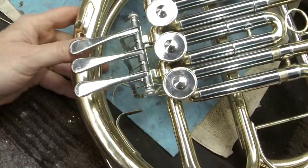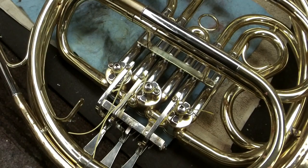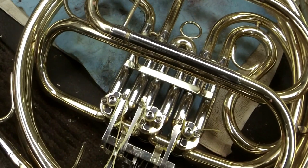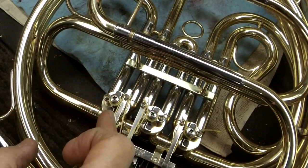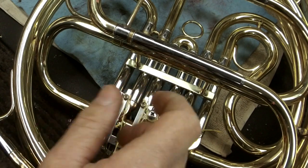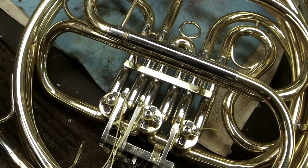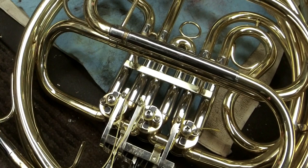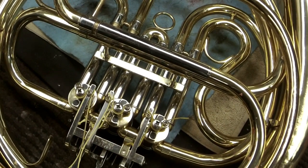When you've been doing this for 33 years your fingers get really quick and used to it, but most folks do this once every five years and it seems like a mystery — but it's really quite simple. You go through the lever, around the stop arm, around the screw creating that figure eight, back through the lever, create a loop, then bring it around the lever string screw. Keep the nomenclature consistent and you should be fine. It's a very simple procedure.